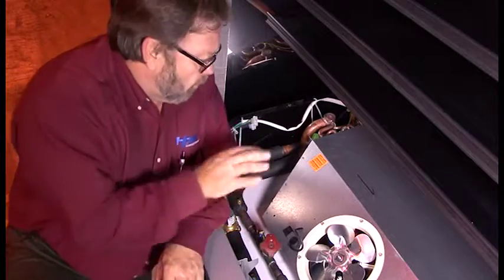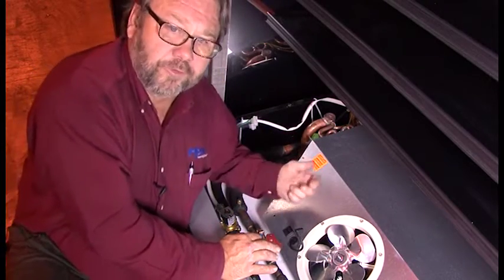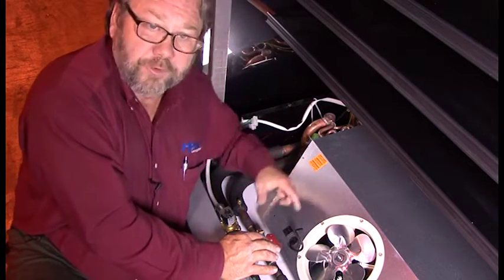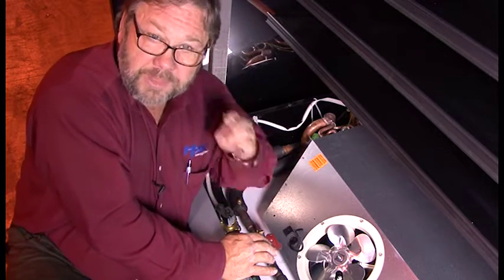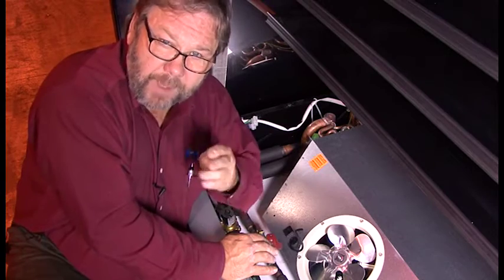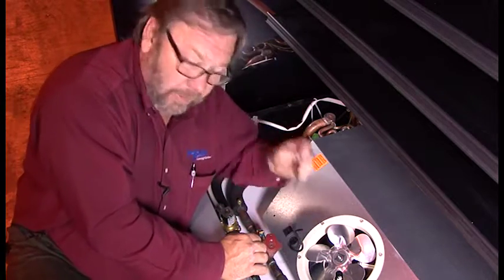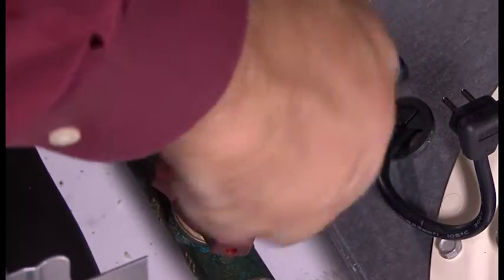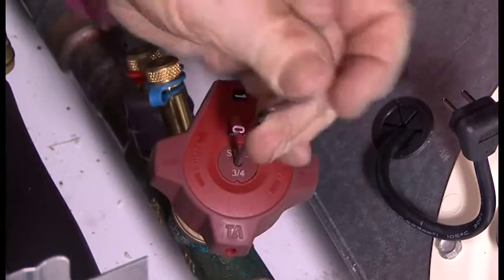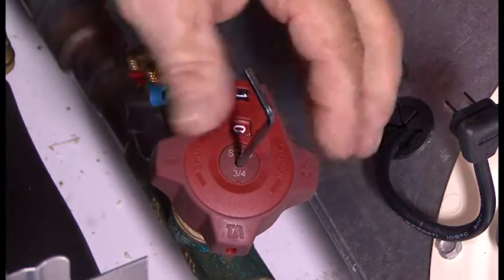One of the things we've talked about is making sure that if somebody comes along and needs to service this case, if an associate accidentally closes this valve and then opens it back up, it stops at 1.0. We want to be able to close it for service. So let's take our Allen wrench, set it through here — remember to stick it in the center of the hole — and turn it clockwise until it stops. Once it stops, the valve is locked.